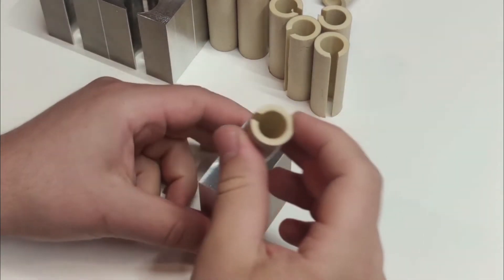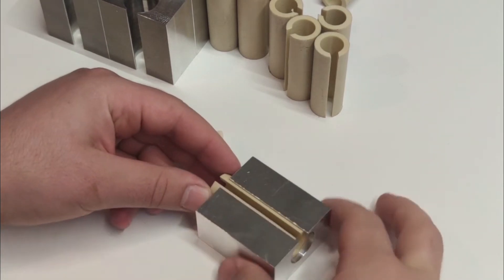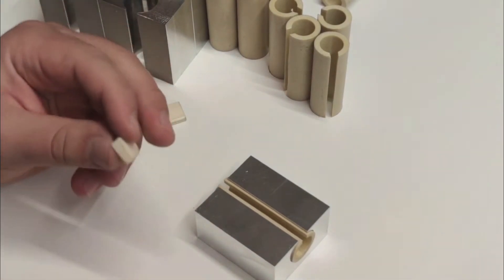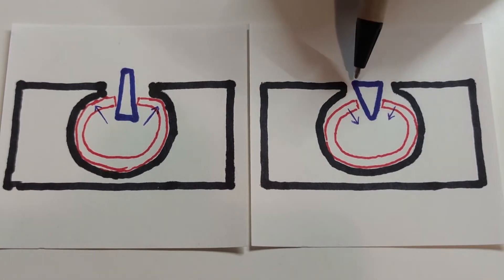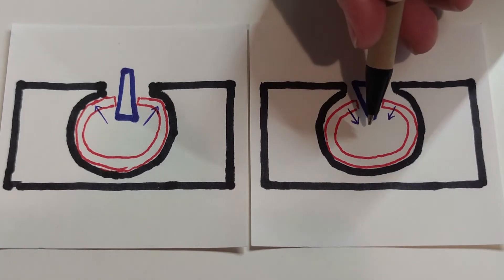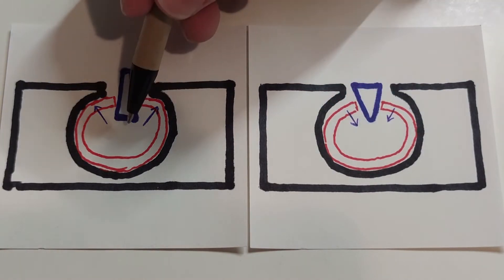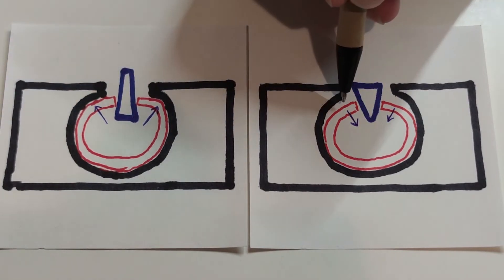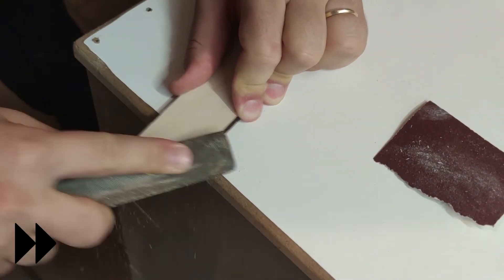The gluing was quite labor intensive since I had to be fast so that the epoxy in the mixing tube did not harden during the process. I also had to come up with a creative idea to fixture and tension the plastic in the aluminum block. It was obvious that some kind of wedge was needed, but if I put the wedge from outside into the plastic bushing it would probably leave a gap. If I could wedge from inside out, I could eliminate the gap and the plastic would be firmly pushed to the aluminum. I created some wooden wedges since wood has some elasticity and I could easily get them out when the glue was cured.